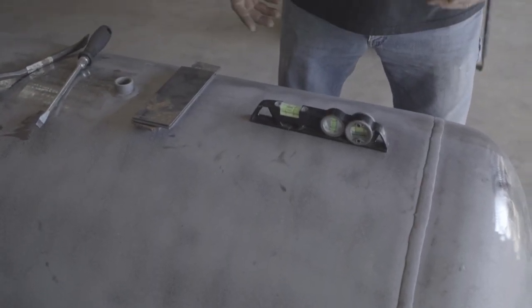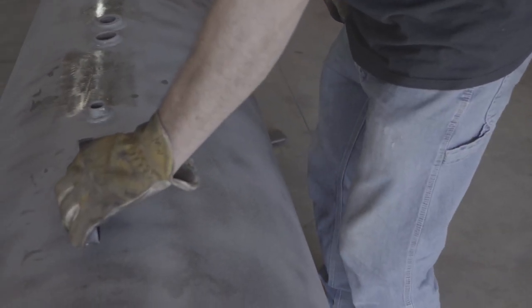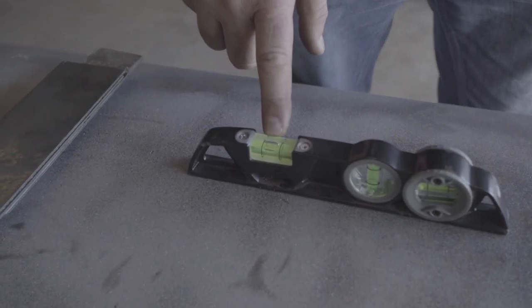So the first thing you're going to need is a few tools. We're going to have to get this thing level. Now we all know that nobody's concrete floor is perfectly level. You look here at the level - we're going to need a torpedo level of some kind. You can use a four footer, but you've got these bungs in the way. So for me, this is good enough. But you can see that this thing's out just a little bit on the bubble. Since that's out of level, we're going to have to shim this thing to get it up. So first off, we're going to need some shims.